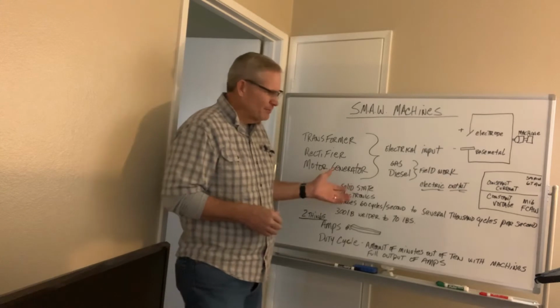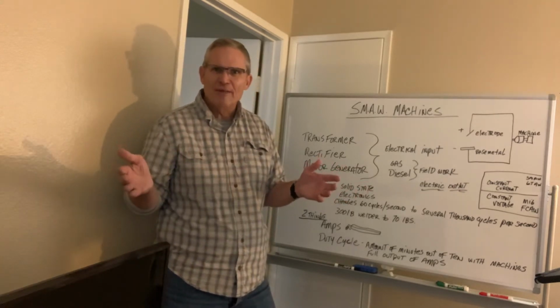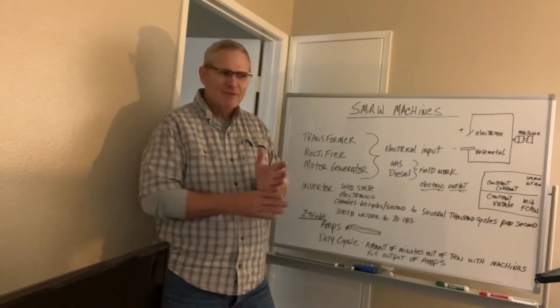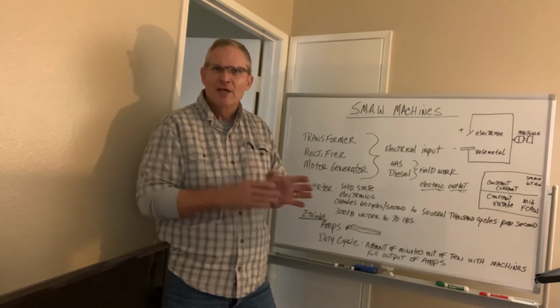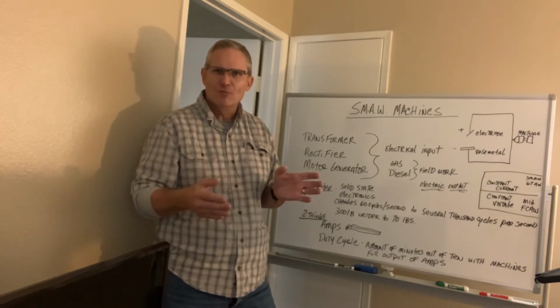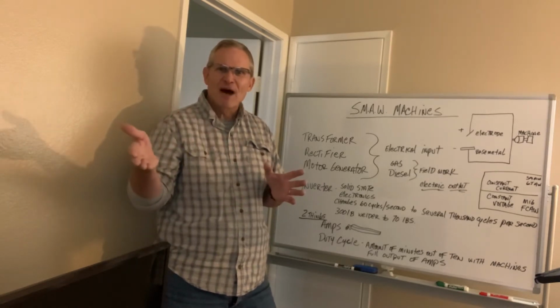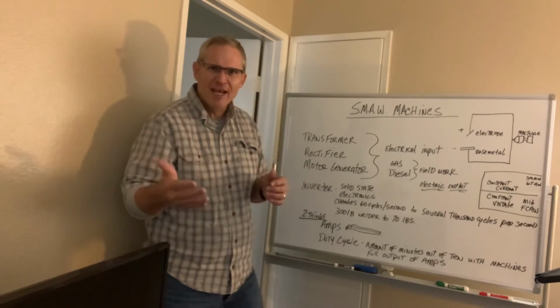Now here at Mount San Antonio College, we have 300 amp machines at 60% duty cycle. Well, obviously you're not running 300 amps. You're probably running 120, 125 amps for the most part. So that 60% duty cycle becomes about 80% duty cycle or more out of 10.